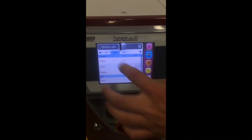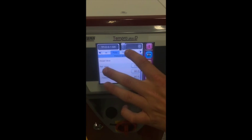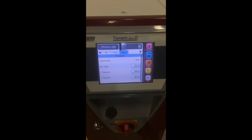Within the pump tab, the pump pressure can be monitored in order to recognize constrictions or pump damage. You can adjust the reference value as well as the plus and minus tolerance from the reference value. The flow tab allows users to simultaneously monitor flow quantity and pump pressure, offering the greatest possible process safety and serving to allow early recognition of pump wear and constrictions in cooling channels. You can adjust the reference value as well as the plus and minus tolerance from the reference value.